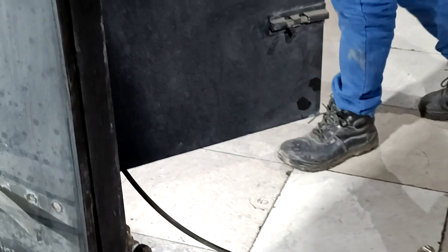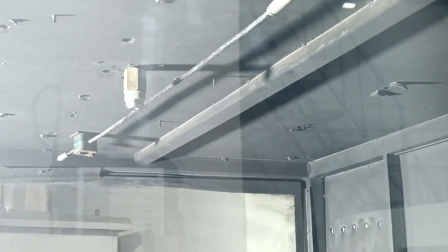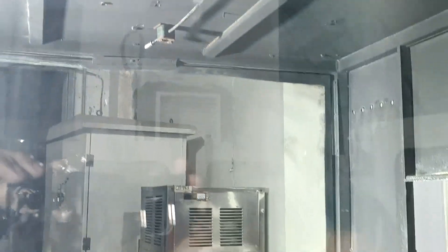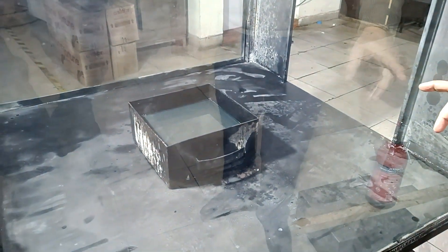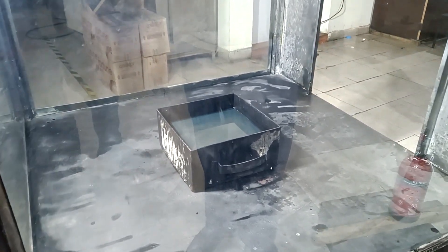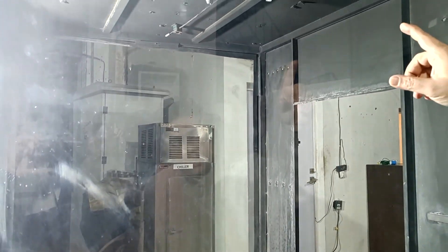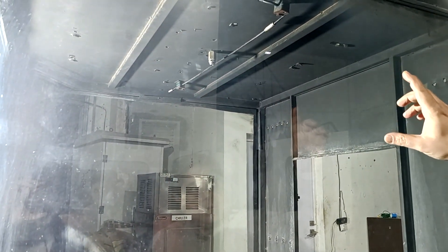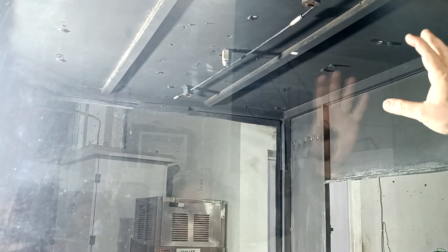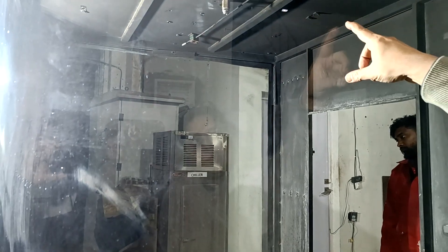Now inside, we have the HST going to the roof, we have the nozzle across, and in the center we have the spray nozzle for powder disbursement. Below this we have a fire source which we are going to extinguish with this nozzle. As the flames rise, the HST will burst, and as the HST bursts, the pressure in the HST drops and the valve gets opened on the top of the cylinder and MAP-90 will be dispersed from this nozzle.